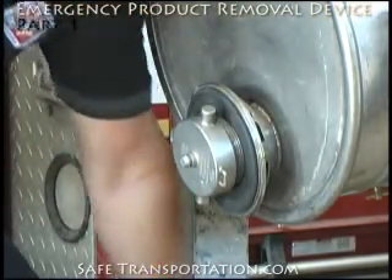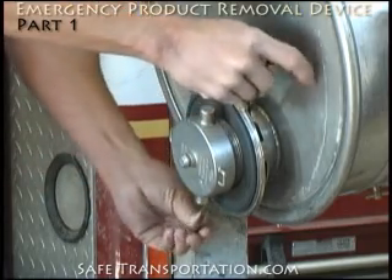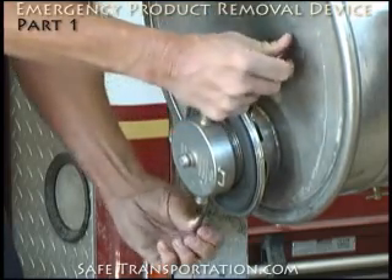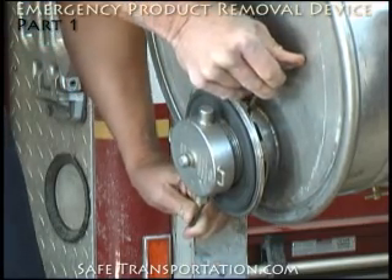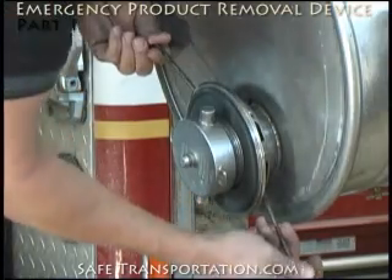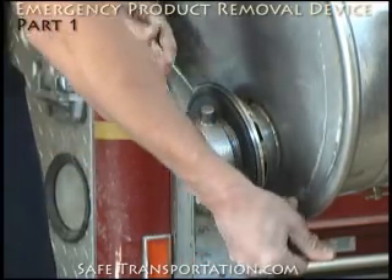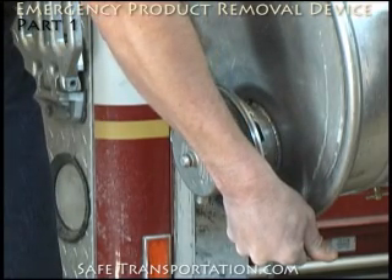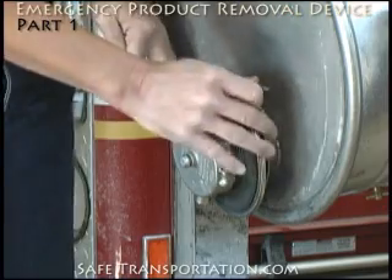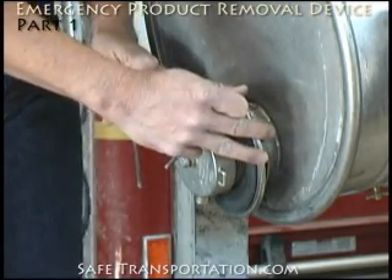If you take two Allen wrenches — and typically you're going to be doing this with two people — put the Allen wrenches into the set screws that are counter to each other. Start tightening them with your partner. When you feel it getting a little tension, stop and wait for your partner. At that point, tighten them a little bit further until finally you're snugging them down together. By doing them together and evenly, you're keeping the clean-out collar nice and centered. Once you've done that set of screws, come back and tighten up the other screws that are counter to one another — there are four in total. Work together to tighten them nice and evenly. Put full torque on these with your hands to make sure they're digging into that clean-out collar and securing them. If you do not tighten these set screws, this is where you can have a catastrophic failure with this valve. Once you start the pump, it starts to vibrate, and it will fall off unless the set screws are set properly and are tight.